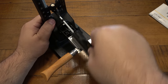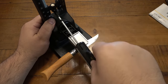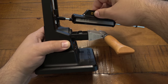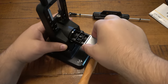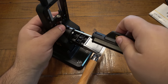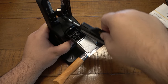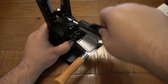Same thing now — just doing the opposite side, keeping a nice consistent angle. If you notice when I push down the system flexes a little, so I'm stabilizing it with the side against the table. There's a little bit of movement up and down — it's very minimal but it does flex. It's important not to push down really hard because that will change the angle. Just go a little lighter on your passes; use the weight of the arm and this piece. It is keeping a very consistent angle.